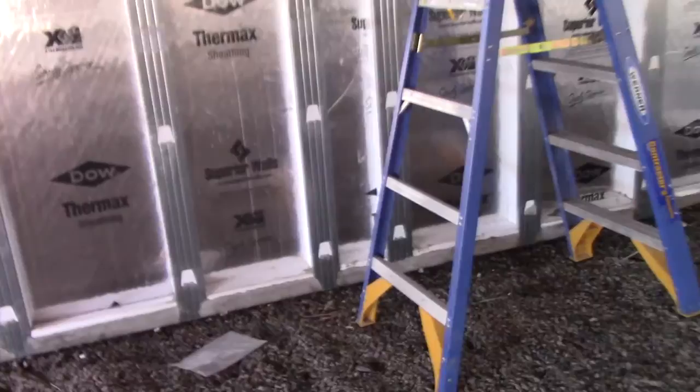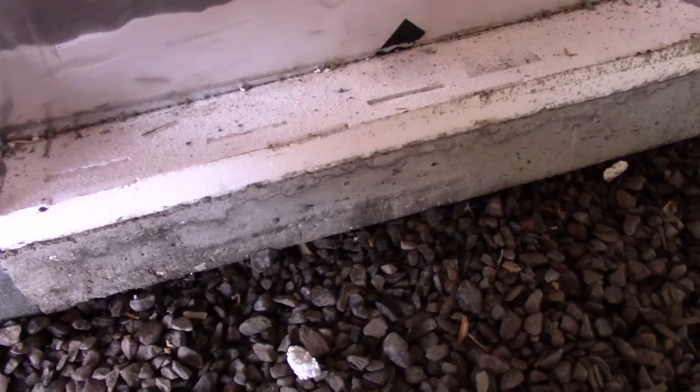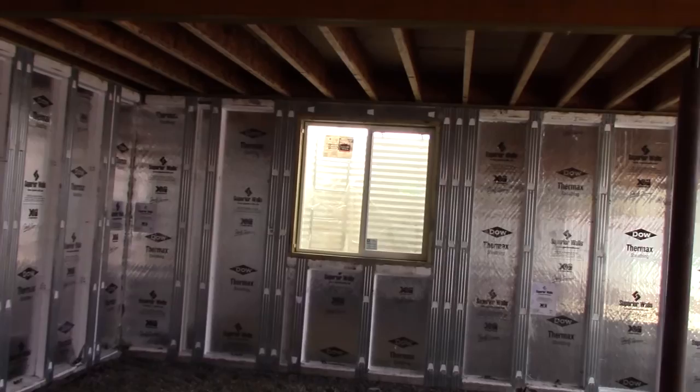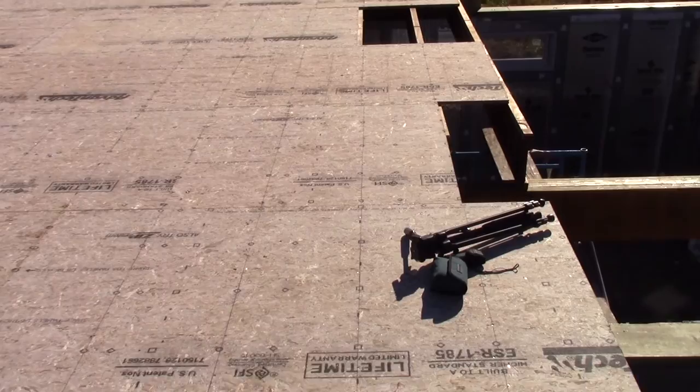These are the superior walls. Basically you've got four inches of concrete and foam that sit here, and this is where your slab is actually going to get poured up against. They just come right up to the edge of this foam, and we put moisture barrier down underneath it. This is all foam insulation. These are sort of superficial steel studs that you can fix drywall to, and then you have your wire chases in here as well. It's a pretty neat system, including that egress window over there — there's three, and there's the fourth one. Now let me take you outside and look at the subfloor.